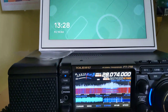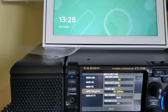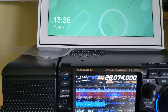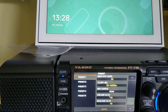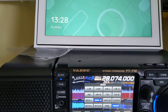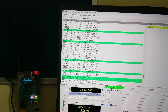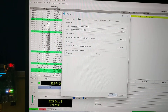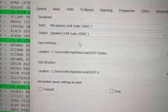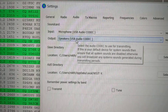To do that I have set the radio up to use data modulation source rear, and also the preset using the modulation source as rear. When I do that, in FT8 under configurations I was able to select the audio source as the USB codec, which has been the option that's been missing when just having the 710 plugged in on its own.